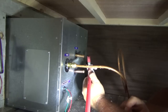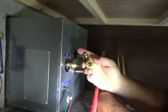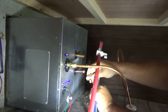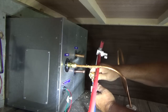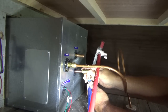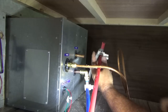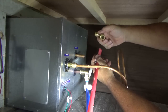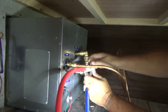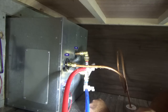Now we want to connect the hot water and cold water. To put the SharkBite on, on the inside there's a small tube — you just want to get it over your line, get it nice and straight so it goes on easy, and then just push it on all the way till it stops. This is the blue — cold input — we're going to connect it on the bottom. Make sure the SharkBite is straight and just push it on. We'll do the same thing on the top hot line — put the SharkBite on first, then scoop the line in and push it on. It's a really snug fit but it's going to work just fine. Our gas line isn't touching the fuel line, so we're good there.